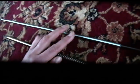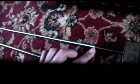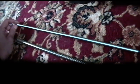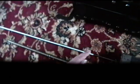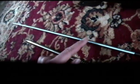So if it's done cold, that means in theory that potentially if I grab this, anchor it off at one end and then pull it at the other end, while it's cold, I might be able to deform it enough so that it maintains its elasticity. So basically yank it out to a good length. So if I was to just maybe even clamp this in the vise and get a pair of pliers and pull this out cold, it may take the new form, and then when it compresses again, hopefully it won't compress back to how it is and stay like that. There will be a certain amount of adjustment.